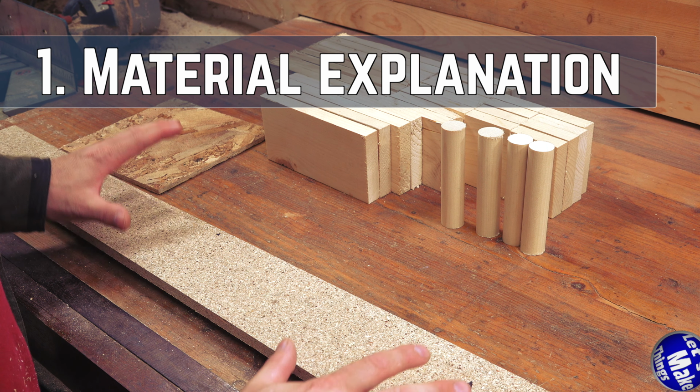On the 3.5-inch side, I went ahead and marked each one of my centers on each one of these handles, and then I found the center of each side. So I've got a mark right here. I'm going to line this up, and all along here, I'm going to add my mark. Again, this is the top. Now I'll go through and drill out each side 3/8 in. I'm going to be using a 3/32 inch bit because I'm using some number 6. These are 1.5 inch. I'm going to glue this, just add a little bit of glue on the top. And there we go. That's the entire frame.